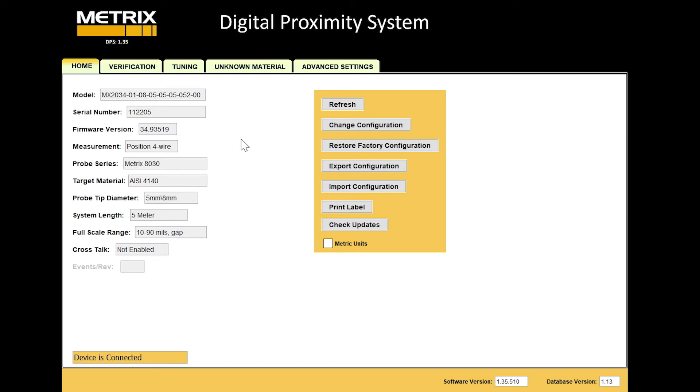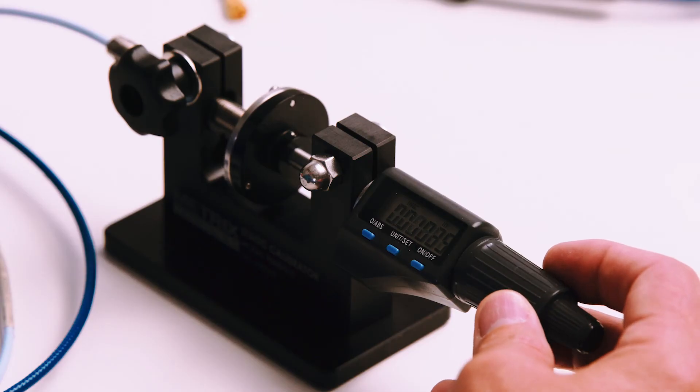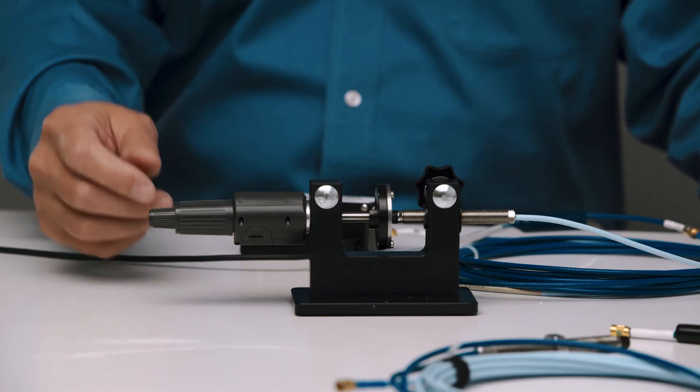That's what we call interchangeability — that's what we call the new normal. That's what the 21st century brings us: digital configurability. It's different than the way it was in the past. Just to show that we're still using the same configuration we started with, I'm going to go ahead and gap this to 10 mils. We'll take data every 10, 20, 30, 40 mils out to 100, and we'll compare that to how we've done previously. We'll look at the incremental scale factor and the deviation from straight line, just to see if it's within specification.